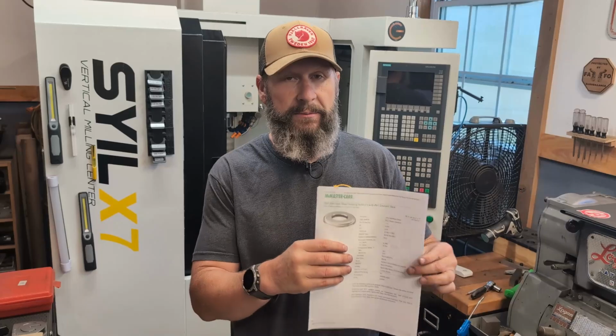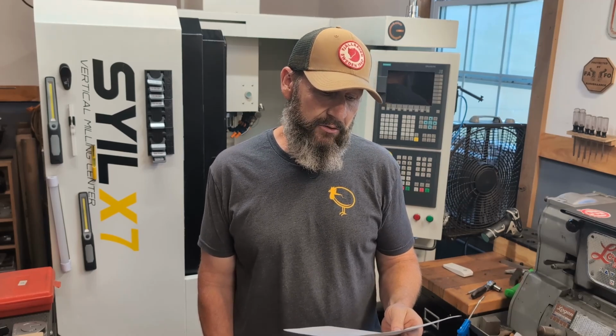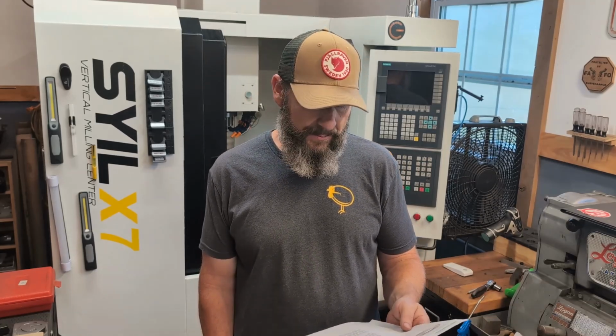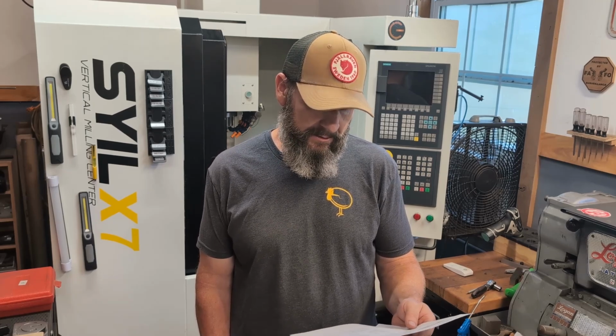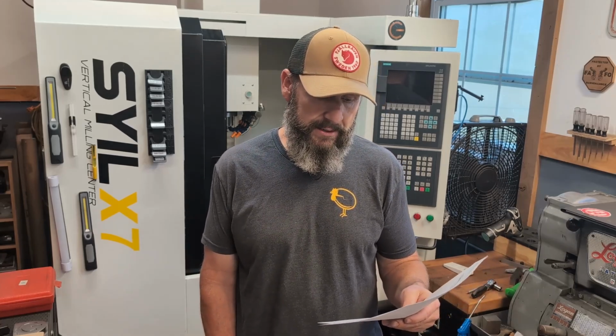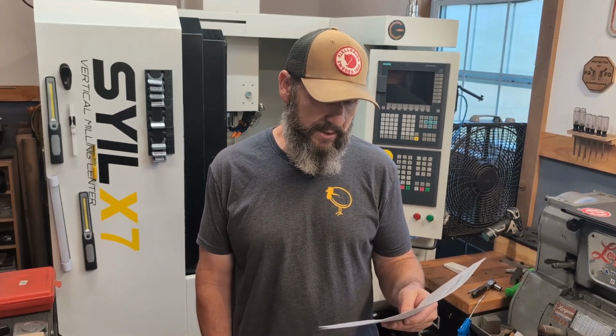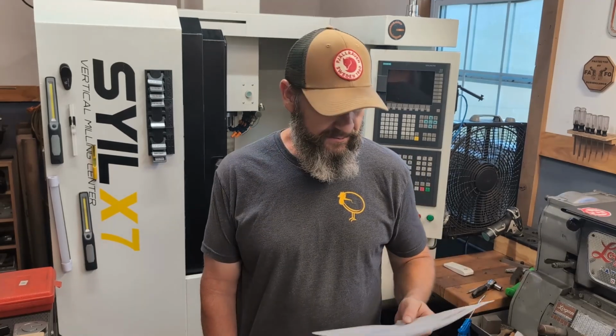I ended up going with these washers from McMaster-Carr. I bought 2 7/16 304 stainless steel sealing washers, and they have a PVC sealant seal. They're rated for high pressure. Let's see here, the description says able to withstand pressure greater than 3000 psi. These one-piece bonded washers create the tightest seal. So yeah, I went with 2 of those in the accompanying hardware and it didn't leak from start to finish.